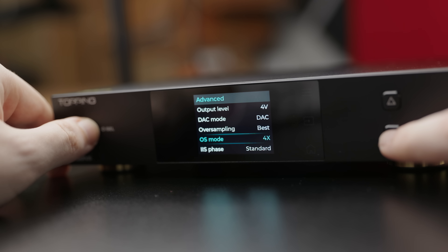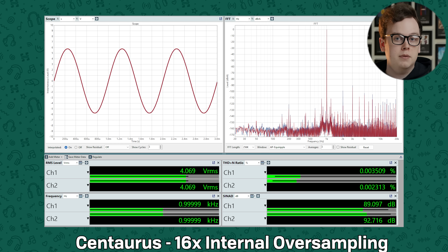Then I tried using the internal oversampling in the Centaurus, which you can configure to run at 2x, 4x, 8x, or 16x oversampling, all the way up to 768kHz. If you pick more than 4x oversampling, it again starts behaving terribly — you get massively higher jitter and distortion, leading to an over 20 dB drop in THD+N performance alone. In comparison, the Cyan 2, regardless of whether I was using its own module or swapping this one in, performed absolutely fine regardless of what sample rate — all the way up to 1.5MHz — I was feeding it. I was only able to keep the Centaurus behaving normally in best OS mode.